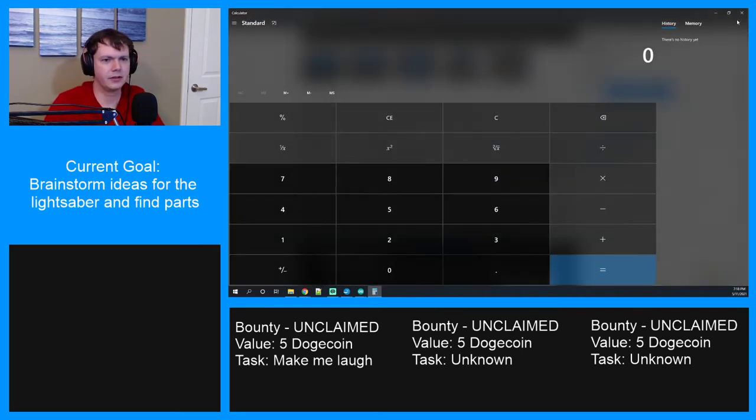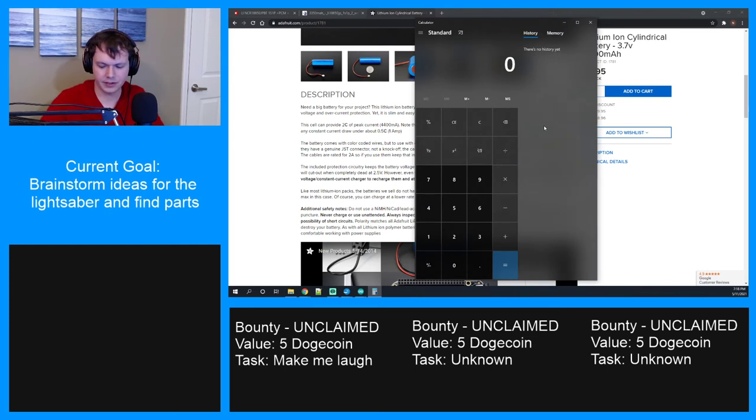So we do 60 milliamps per NeoPixel. That's 1.8 amps. That's a lot. I don't know that in practice we would ever be pulling that much, but if you're going full white brightness, 30 NeoPixels would pull that much.